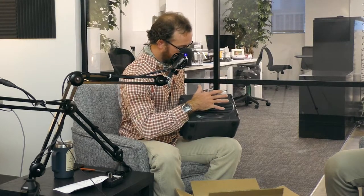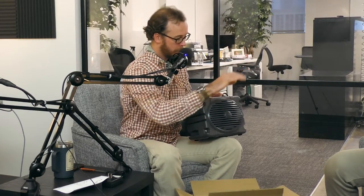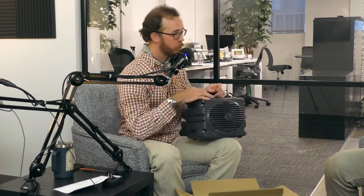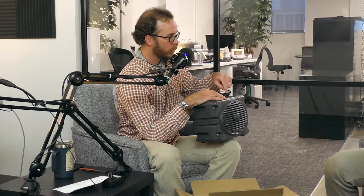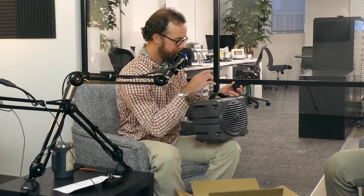Depending on the pressure of the airplane, we've seen it do really weird things inside the box. The weirdest thing it does is it takes that speaker and will protrude it out — it'll build up so much pressure that it'll push the cone out and destroy it, severing the voice coil. So we are currently not shipping two-day air anymore. The fix is: if you just loosen that cap a little bit, it'll breathe. What we're going to start doing at the factory level is having them not tighten these, and we'll put a little sticker on there that says 'tighten before use' or 'loosen if flying.'